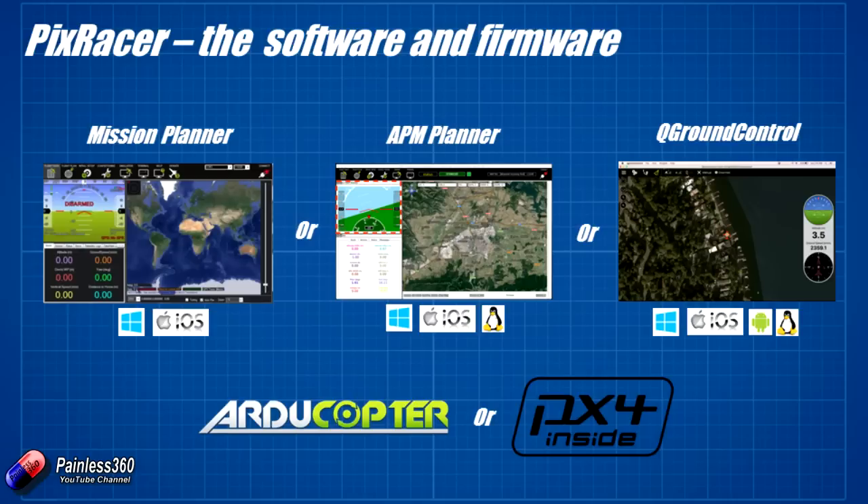The last one on the right hand side is the one we'll use: QGroundControl. QGroundControl is still in development — very much the new kid on the block. We're taking a little bit of a risk using it before it's fully released, but I wanted to show something a little different. We're also using QGroundControl because we want to use the PX4 firmware. At the bottom of the slide, there are two firmware options: Arducopter or PX4. Arducopter is part of the Mission Planner/3DR project — Arducopter, Arduplane, Ardurover — it's very mature, highly tested, and very portable. I love the Arducopter stuff; it works beautifully.